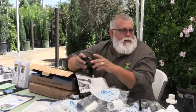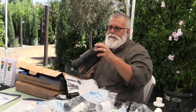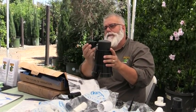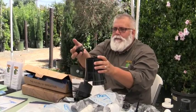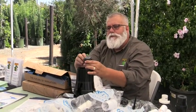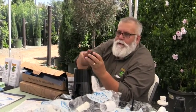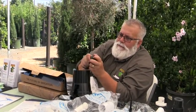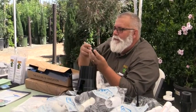You can put this in a little valve box like this — the box goes down under the ground, and the device comes up into this area. If you want to keep it hidden, bring your mulch right up to it. If you've got too much or too little water, you just turn it one way or the other. It can run eight plants, it's pressure regulated, and it comes with a filter.